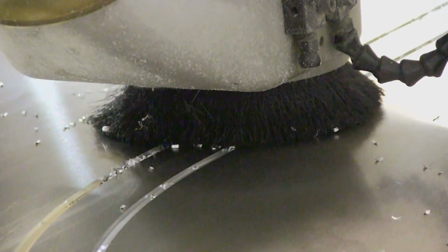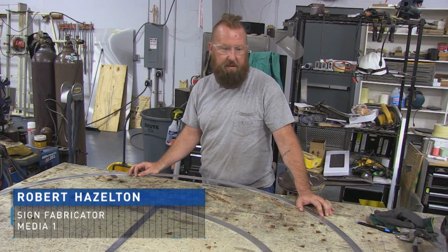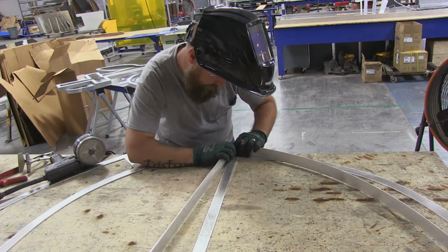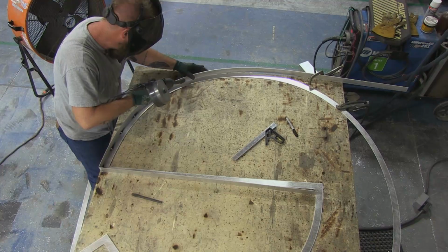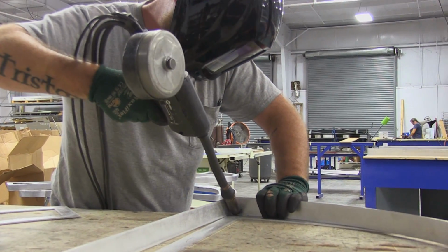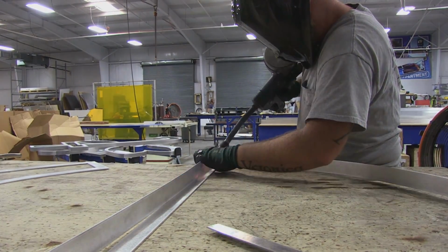This is the retainer for the same E that Steve is building right now. The retainer is what actually holds the acrylic onto the channel letter return. I'll bend 1.5 inch metal all the way around it and weld it to this face piece. These are a little tricky because of heat and warpage. You can't go as fast on these as you can go on the returns.